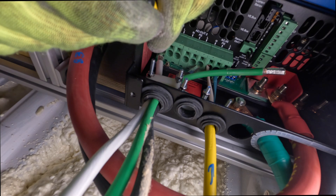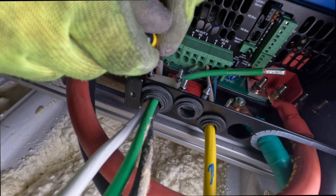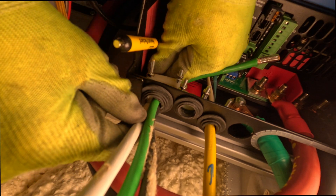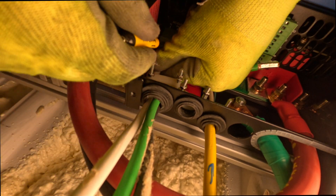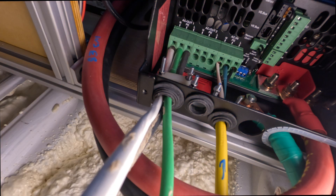We've run our first cable through the entry gland, and we're going to use this tiny little screwdriver. We're going to put that in that hole there until we hear a couple pops, and that's going to open up the channel for the male and female entries to go through for all your conductors. Once your cable's in, take your screwdriver out and test it for tension.